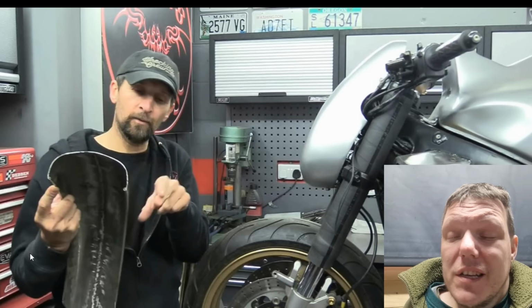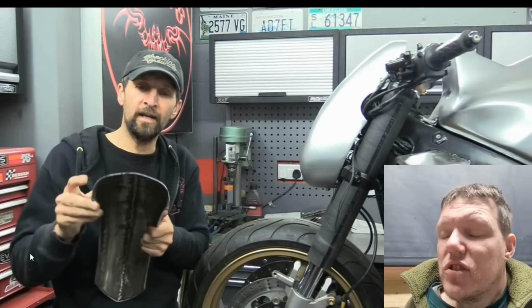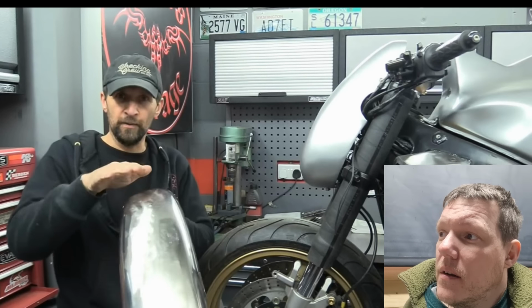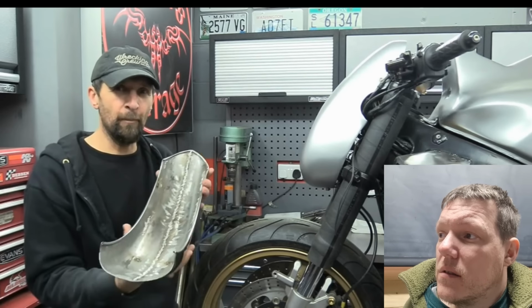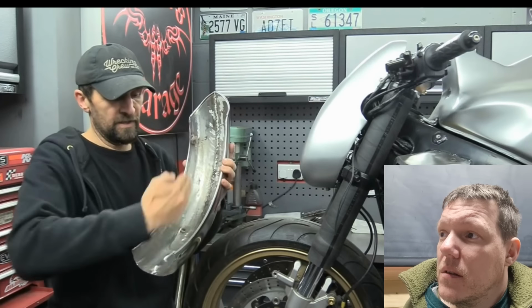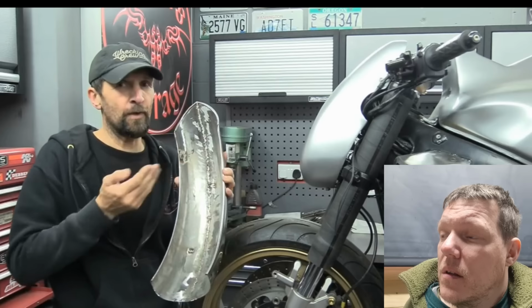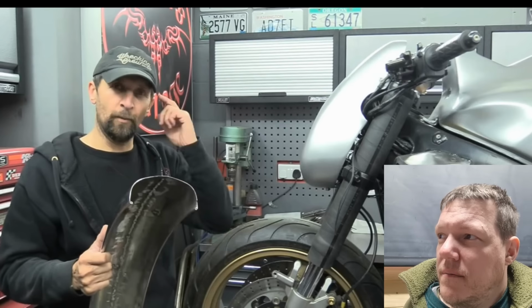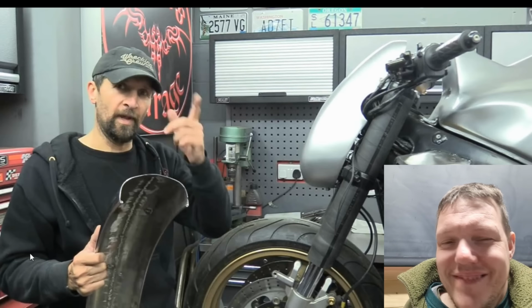So let's see if he gets the square cutting down there. Even just to get in the ballpark. So it will curve that way and it will just look wrong. The whole thing when you're finished will end up twisted. So it's pretty important to get where the cuts are in relation to the centre line, absolutely 90 degrees across it. So that sort of thing also matters. Fabrication is not difficult. It's just a little bit. Oh, it is, Del. It is.